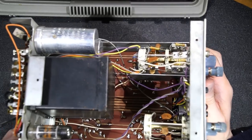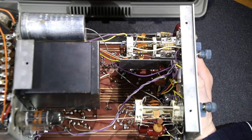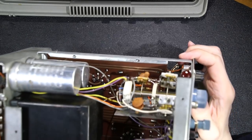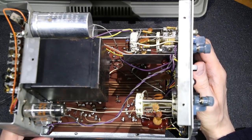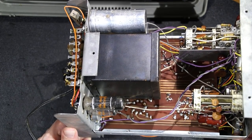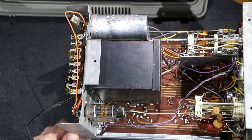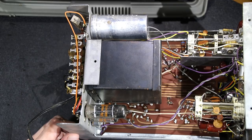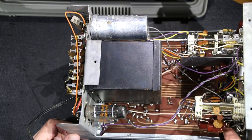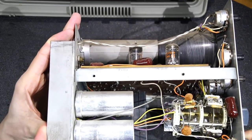Now this has that standard kind of a fluxy looking residue left over everywhere, and it really doesn't look like it's been tampered with. It's looking pretty clean under here, so I think that those capacitors were most likely put in when this was assembled. So most likely they just upgraded the capacitors because they found that those other capacitors were leaking, which would make a lot of sense. So RCA tubes in here still. As we can see here on the sweep selector, it's got the polystyrene capacitors there. They're everywhere in here. So this thing was just built with those capacitors.